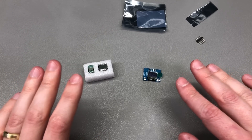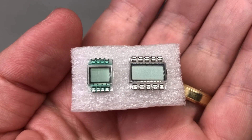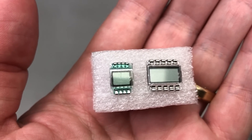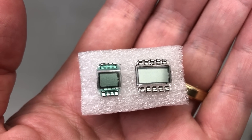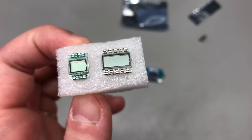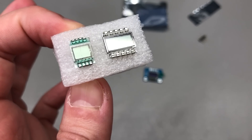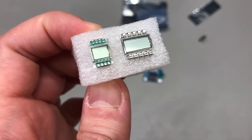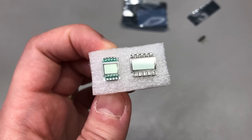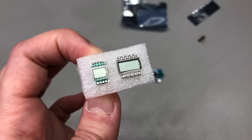Next I have some very interesting display technology — I just have to be really careful not to lose these really tiny and cute segment display modules. These are based on TN panels with reflective polarizer films, no backlight, no driver. I have the 2-digit version and the 3-digit version, and just look at how small these are compared to my fingers. I believe these could enable some very interesting miniaturized projects — they were certainly very popular when I shared a picture on my Twitter. Let me know in the comments what you would build using one of these, and check out the links in the description.